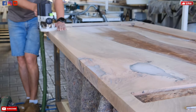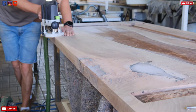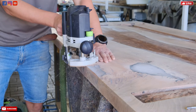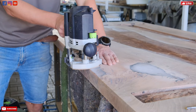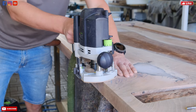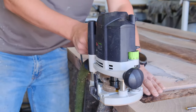While I was busy with the router I quickly changed to my 45-degree chamfer bit to give the underside of my table a small 45-degree chamfer right around the edge. This is just to smooth the edge off, and this is the overall look we like going with when we design and manufacture all our tables in our small shop.